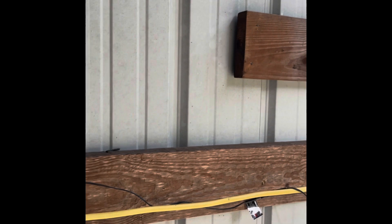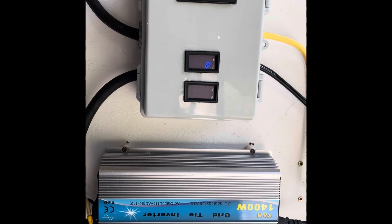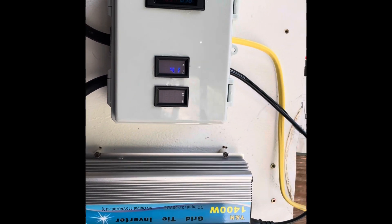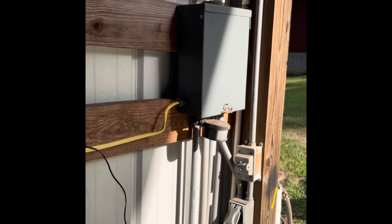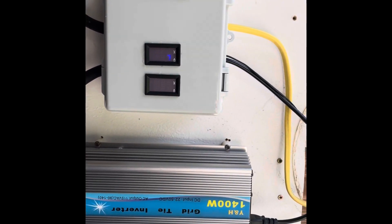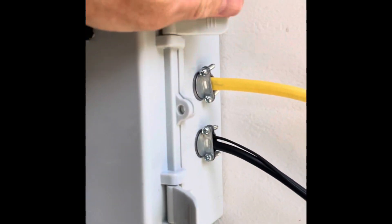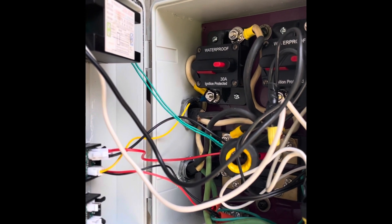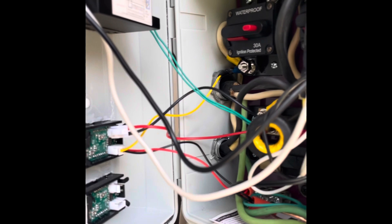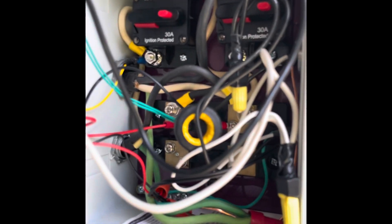This ties over into my shop panel with number 12 wire, just feeding into an existing breaker in there, which basically puts this power back into the main grid — same thing as plugging it into a receptacle, but I wanted to tie it straight in. The DC meter is pretty neat, but I did have to supply separate DC power for it because it's only rated for about 28 volts and my panels are putting out a little more than that when connected.